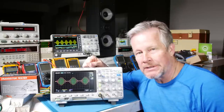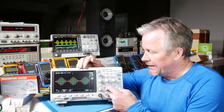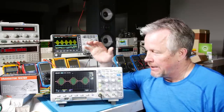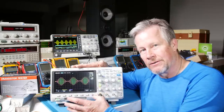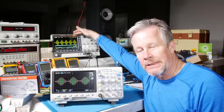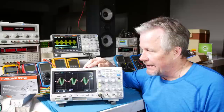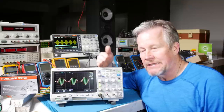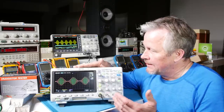If I really want maximum resolution, I only need one channel — turn the other off and I get the full 1 gigasample on that channel. Now if I get the 100 MHz version, I'm still going to get 1 gigasample, because when manufacturers make these oscilloscopes the board is capable of 1 gigasample. They'll make a 200 MHz, 100 MHz, 70 MHz, and 50 MHz version — they're all 1 gigasample per second. So if you get a 50 MHz scope, you're getting lots of sampling and your digital bandwidth is great.